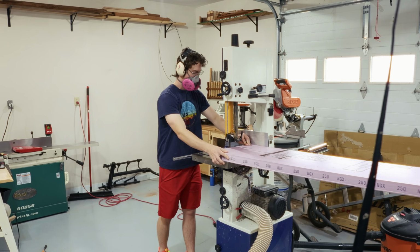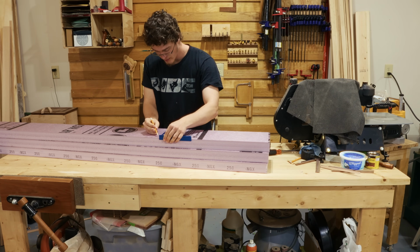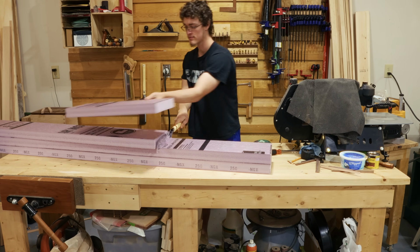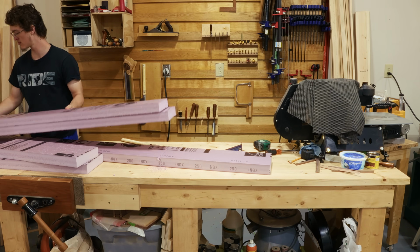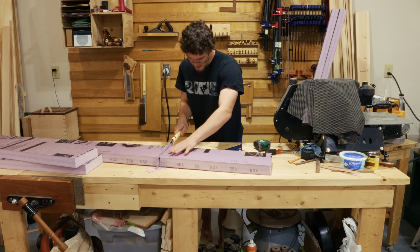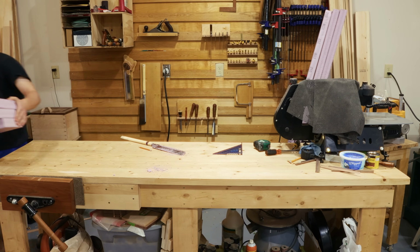The snowboard is made up of a number of different materials that get layered together and pressed in a mold to create its shape. And that's exactly what I'm working on right now. With the goal of keeping costs down and for the ease of shaping, I decided to use a high-density pink foam board to form the mold. While it did have a high enough compression rating for what I'd be doing, its lack of stiffness did cause a few issues later on that I'll get to.